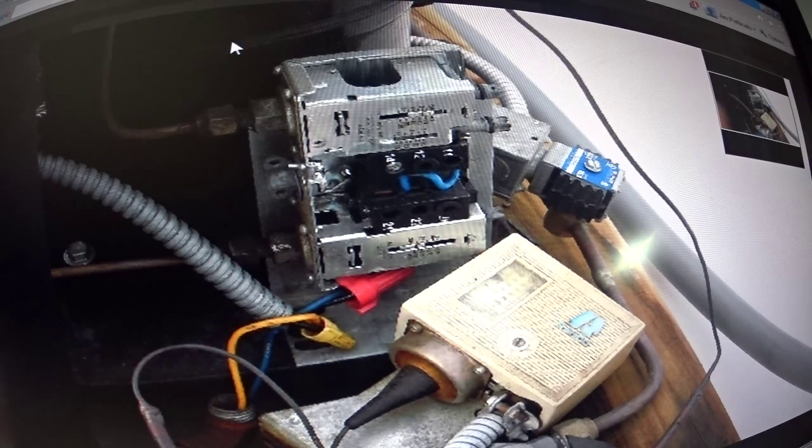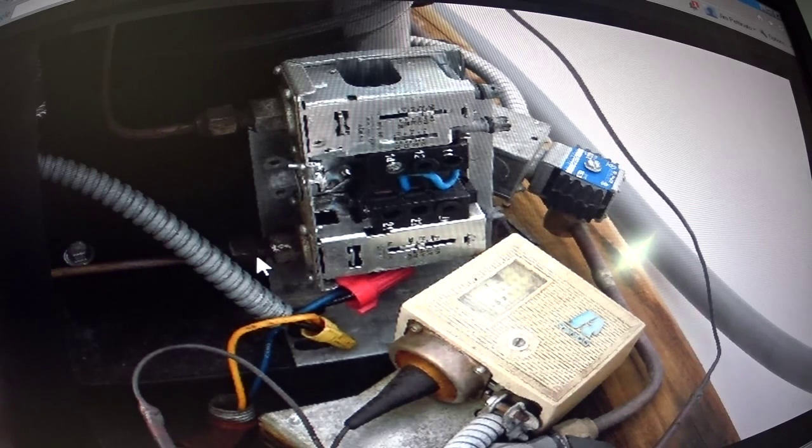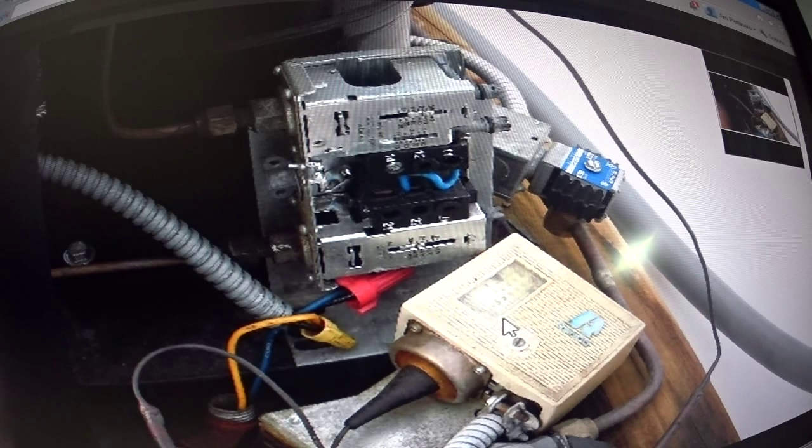Apparently after he started up, he found that the pressure control was bad. It's a dual pressure control. It's got your low side function here and high side cutout function here, but it had gone bad, and this guy didn't bother removing the old control and putting a new control in. He just left the old control where it was because he didn't want to pump it down, take the gas out of it apparently. And he just reconnected this one to the system. And this is an old one that he had apparently. It was all, you see, it's rusted.